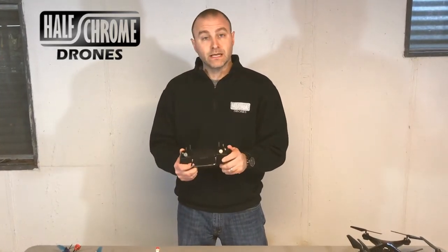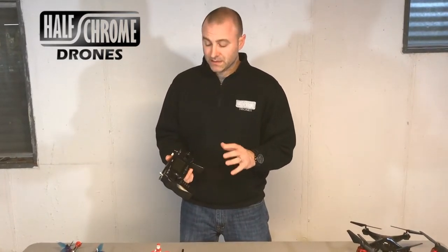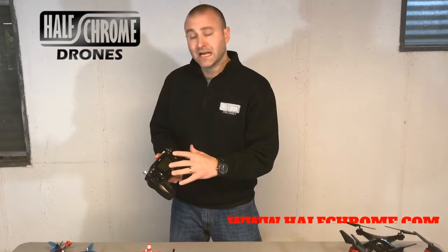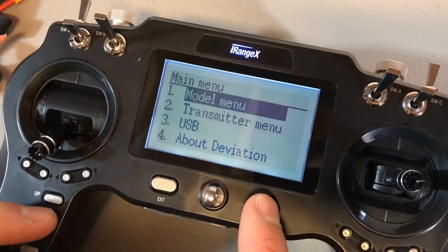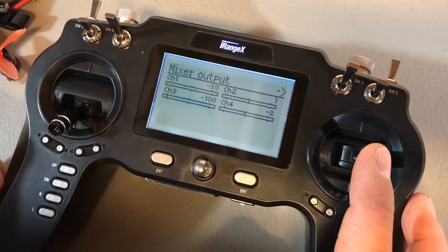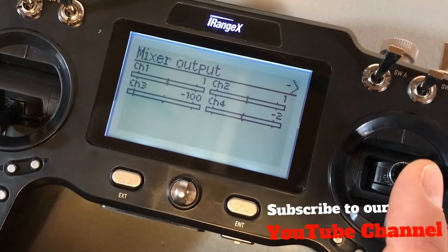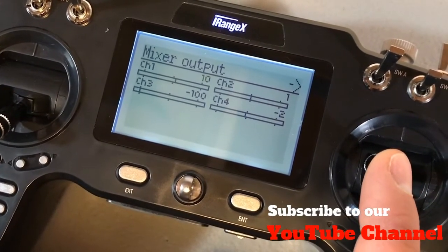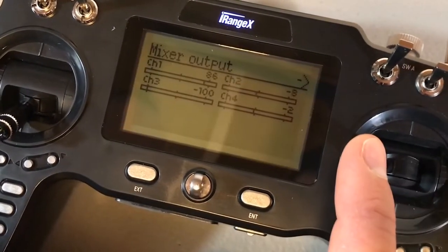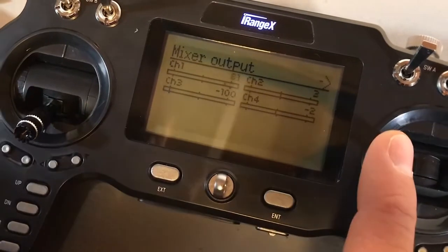It can be done if you really like this gamepad style feel, but it's a pain. I also noticed the inputs aren't super perfect — they're not as nice as they need to be. It's kind of jumping back and forth; I'm not getting smooth controls like I should be. I'm going to the channel monitor here to take a look at why that right gimbal isn't operating correctly. I've already reversed the directions — you can see as I go right, we're getting negative. But it just isn't operating smoothly. It's moving and not following along. I'm almost all the way there and it's only at 30, 40 — it should be at 100. It just isn't cooperating in either direction, both right or left.